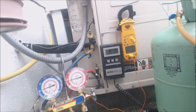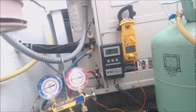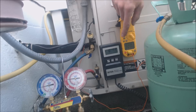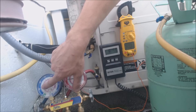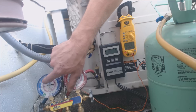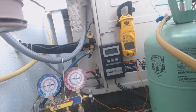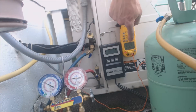We're at about 27 degrees in the evaporator coil. We've now put in 12.2 ounces. Our vapor pressure is right at about 59.5 PSIG. The saturated R22 temperature in the middle of the evaporator coil is 33 degrees, and the vapor line reads 56.5 degrees, so we have about 23 degrees of superheat. We're going to continue adding refrigerant to bring the vapor pressure up and get this temperature down.